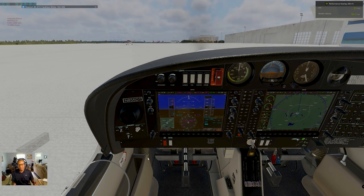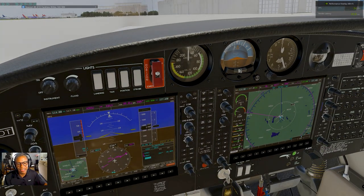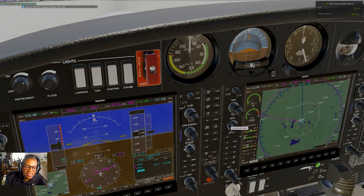And just like that, we are started. Oil pressure has come up and it's in the green. At the temperature outside, it won't take the oil temperature long to come up. And I've got positive volts and positive amps plus 9. And the gearbox temperature is coming up.